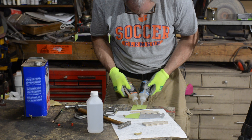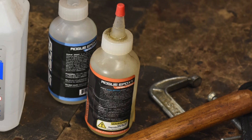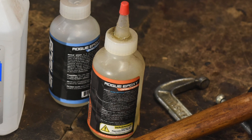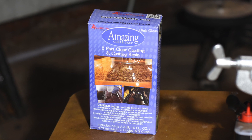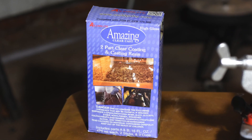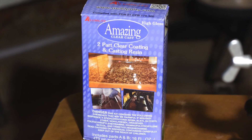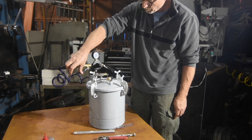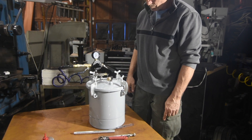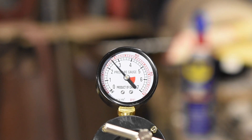Damn near anything you make involving sticky stuff like epoxy or resins will get bubbles in it. Because of the viscosity of these materials — unlike water or alcohol — those bubbles will just sit there and you end up with ugly haze or even large visible bubbles in whatever you cast. If you pressurize the material though, those bubbles will get squashed down to a microscopic size and for all intents and purposes disappear, leaving you with a really clean, bubble-free material.